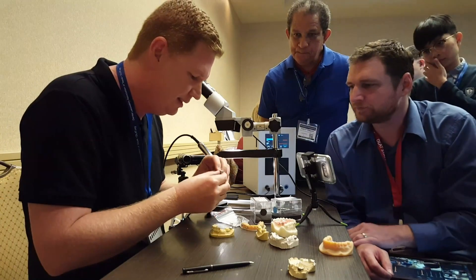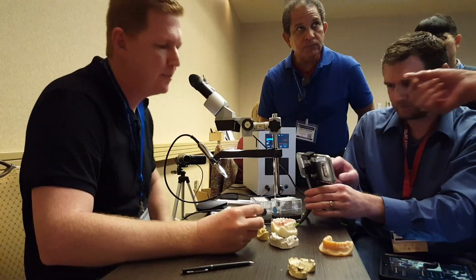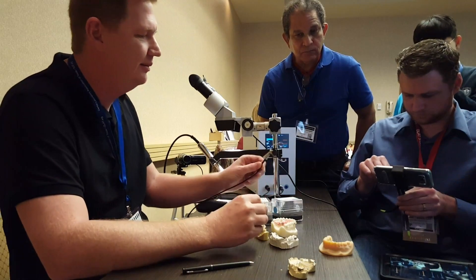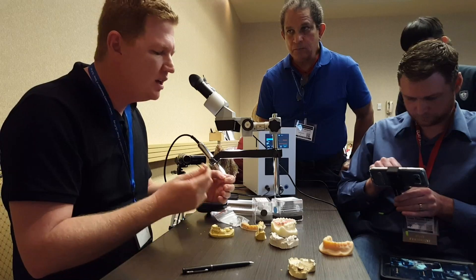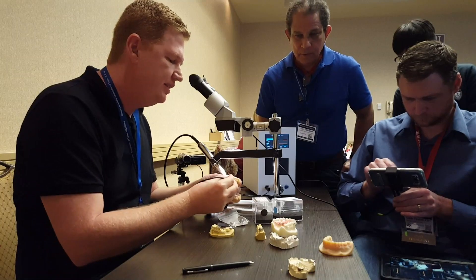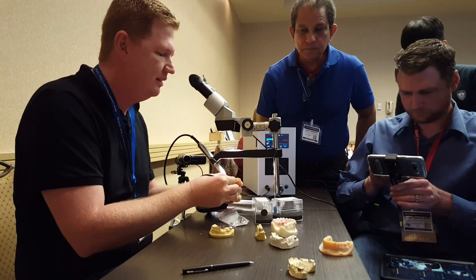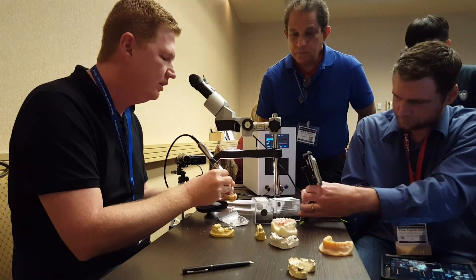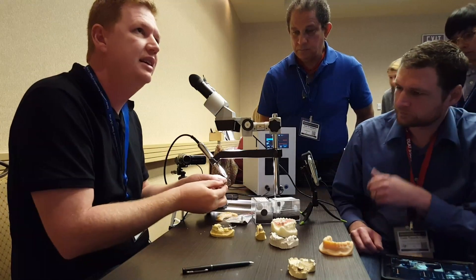So your initial weld — you always want a clear electrode connection. Like when I did this one, you just want contact with it. You can hold it on — I would just brace it with my finger and weld the connection right there. If you don't want to do that, you can just hold it, maybe do one or two welds on there, then take it off, clamp it, and then it's really easy to work with.